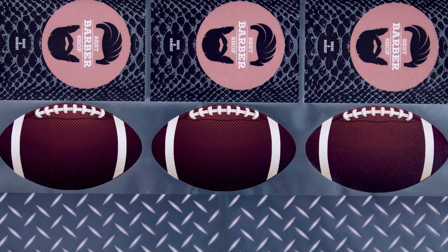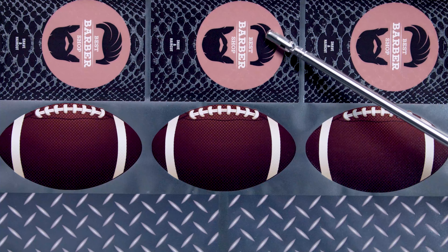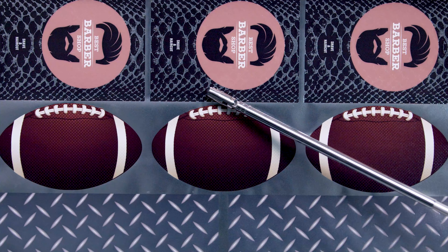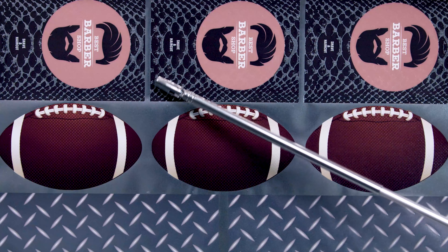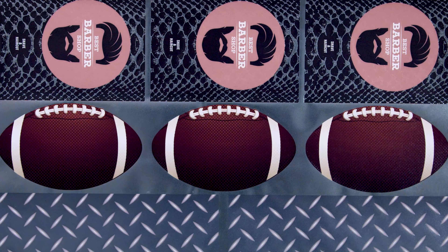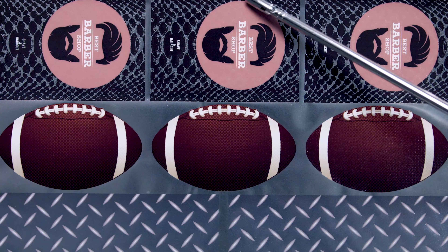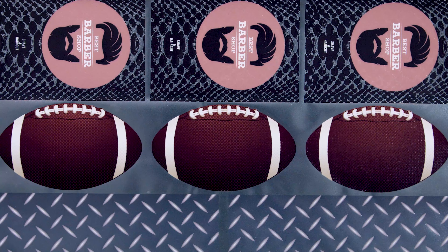Starting with the barbershop label at the top of the page, we see a textured print using white ink, color ink, and digital varnish in combination. The snakeskin texture covering the entire label is created by printing white ink, color ink, and digital varnish as gloss. The non-raised areas have matte varnish printed to provide a contrasting texture, with no white ink or color ink printed in these areas in order to produce a maximum height difference between the peaks and the valleys.